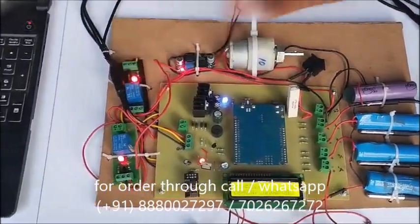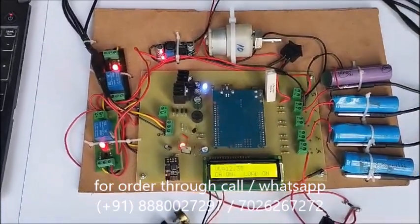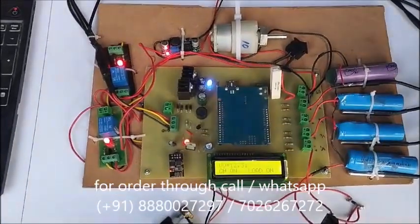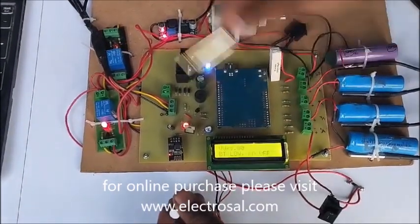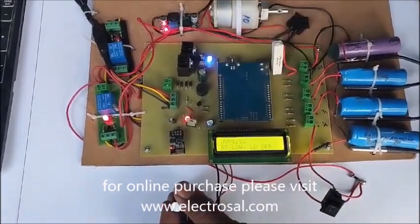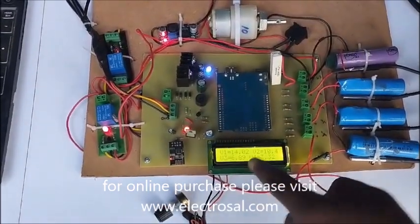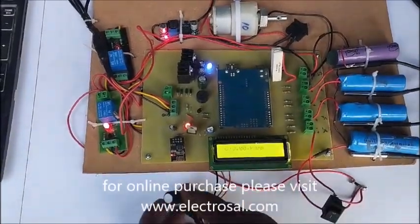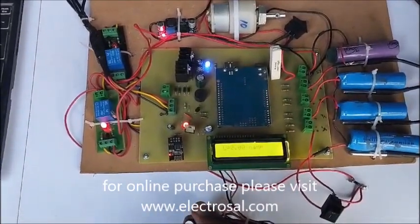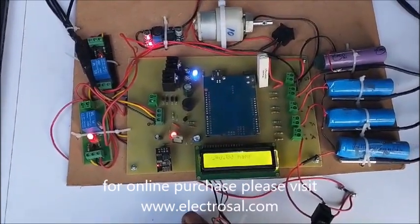Load is on via the relay, but manually the load was off — I started it now. We can see: if voltage is less than 10V, the load cuts off automatically. Then it goes into the temperature loop, voltage loop, voltage of each battery, current, and then continues.